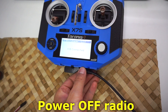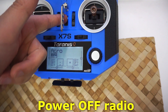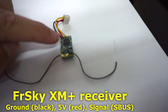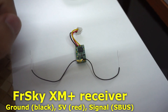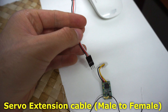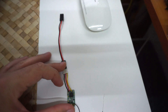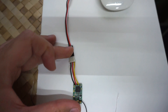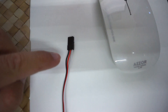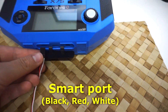Remove the cable, exit, and power off. Here's the receiver: the left pin is ground, the middle is positive, and the right is signal - I've soldered a connector on it. Using a cable where the black wire is on the left, red in the middle, and yellow is the signal on the right - same arrangement: black, red, and signal.